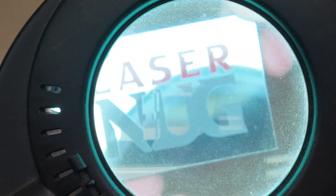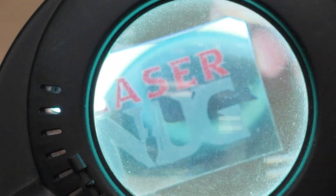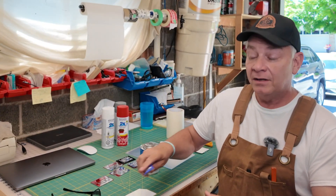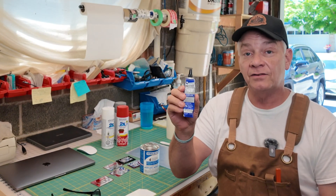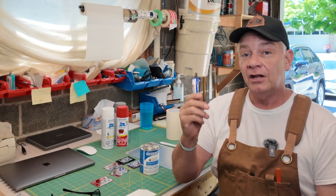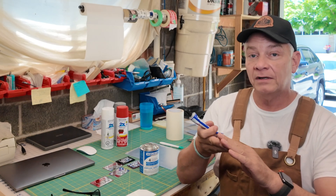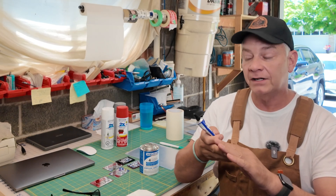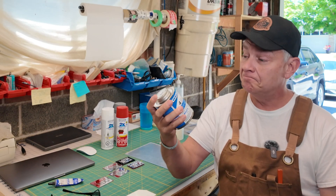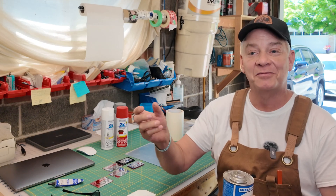Now you can see one consistent, beautiful flat paint job — it came out beautifully. Quick recap: number 16 cement works great for coloured acrylics on coloured acrylics, but not for mirrored acrylic because it breaks down or dissolves the back mirror finish. Weld-on works really nicely on it, as long as I practice and stop dripping it so much.